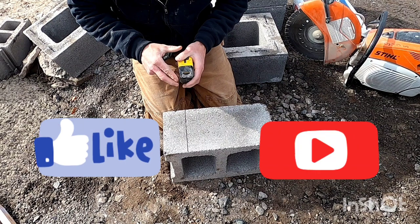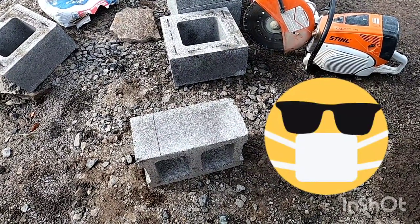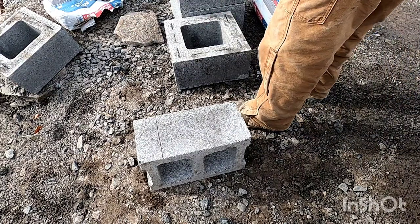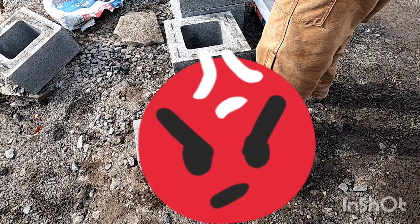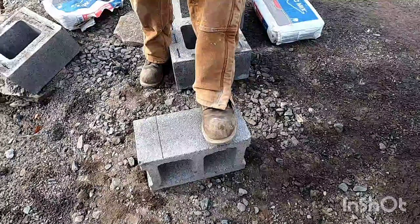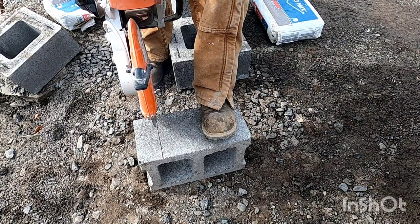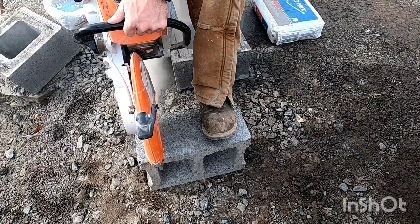Now I've got to cut it. You should wear safety goggles and a mask and stuff like you're supposed to. Once you get your saw started, the first thing I do is put my left foot on the bigger side of my block — that keeps the block still so the saw won't throw it into me while I'm cutting. Then I hold the saw as straight as possible and trace that line I made with the saw blade. This helps me keep the cut super straight. Then I come back to the start and bury the saw through the whole block.